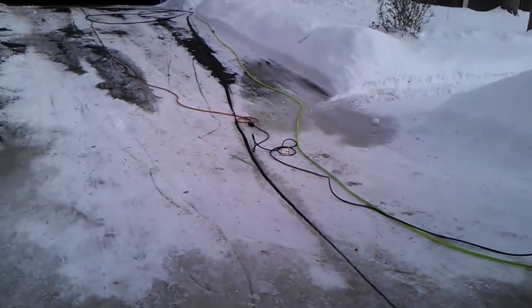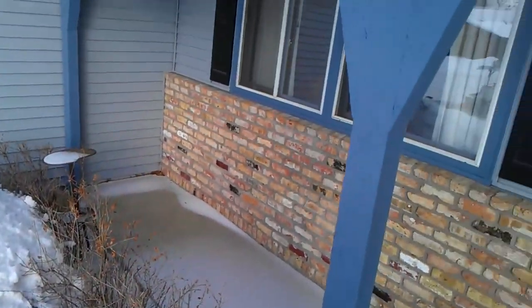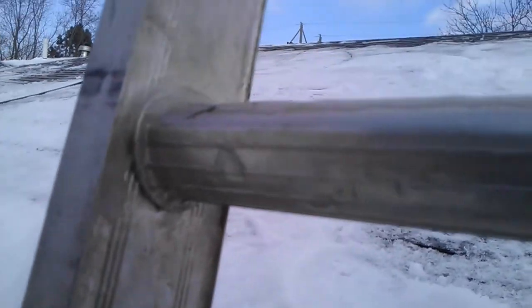how the steam works to cut through the ice. So basically, once water has been turned into steam, it can no longer cut. I'm sure everyone is familiar with how water can cut through things. They have crazy water jets now that cut through metal, and you know, a pressure washer can easily cut through things such as wood and so forth. And basically that's the same thing that's going to happen up on your roof. You put too much PSI up on your shingles and they're going to get cut. You're going to have holes in your roof and you're not going to be happy.